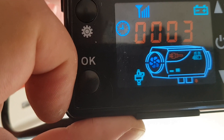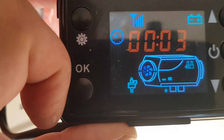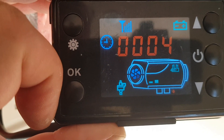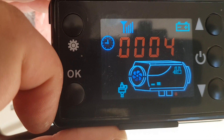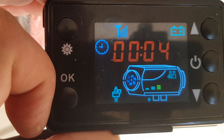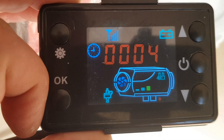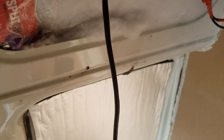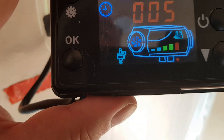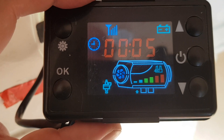That's the glow plug out, and the unit's now going to turn itself right up. I might have to tune this because I have a feeling the settings might be a little bit wrong for what I need it to do. But that's certainly going now. That sounds like maximum fan speed and probably maximum fuel delivery as well. There's the third temperature bar come up. We are almost at temperature - we've got five bars up, and there's the six. We are now at full working temperature.